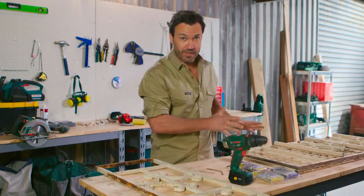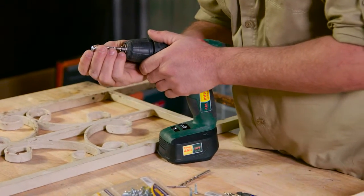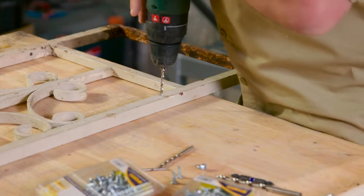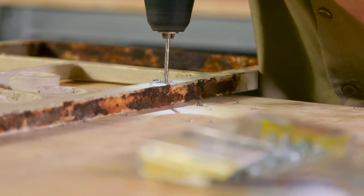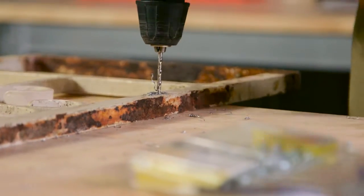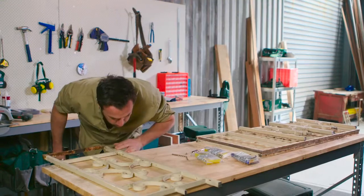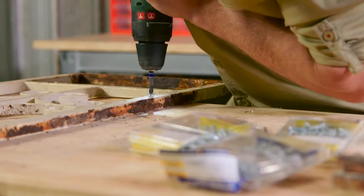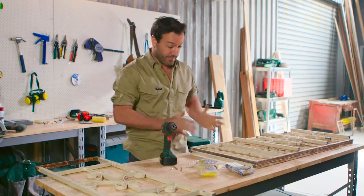Because it's really tough, I don't want them breaking off on my good table. What we're looking for is a drill bit that's about the size of the shank — you want to still hold the little ribs of the screw so that's going to bite into your steel. When you're drilling, put a nice lot of pressure on the back of the drill and go nice and slow. You know when it's working because you're getting these little apple peel-like shavings coming through. Now I've done my test holes, which is really important because you don't want to be breaking screws in your good stuff. Now we can put it all together.